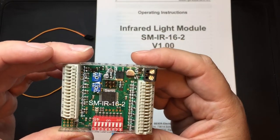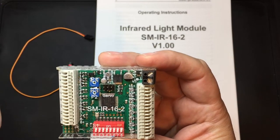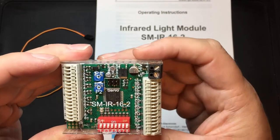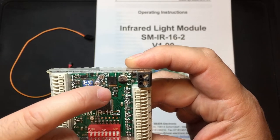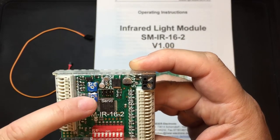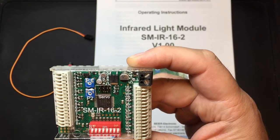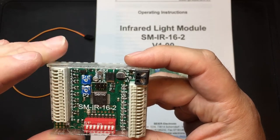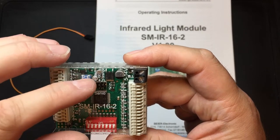The little P1 and P2 pots are for controlling extra light output functions and speed. We also have connections one and two so you can connect two servos. You could use the servo for a rear steer axle or to operate an arm — two functions. Depending on the load of your servos, you either directly connect all three cables or just the signal.